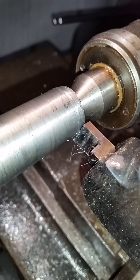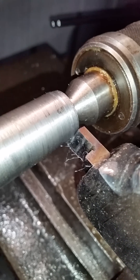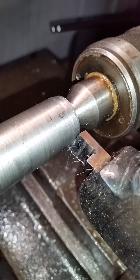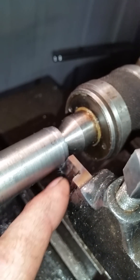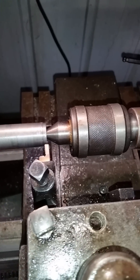As you can see - and I'll give you a drawing of it - you don't have to have it on center height, you just have it on the center line of the work, roughly in the center line of the tool. And you go very, very slow speed and slow feed.